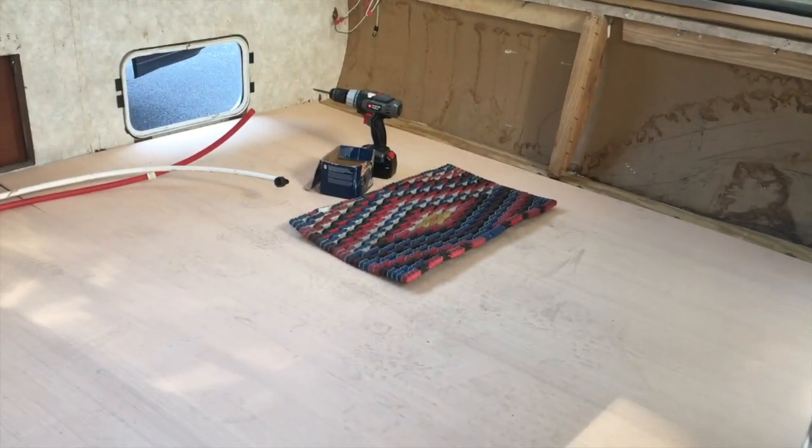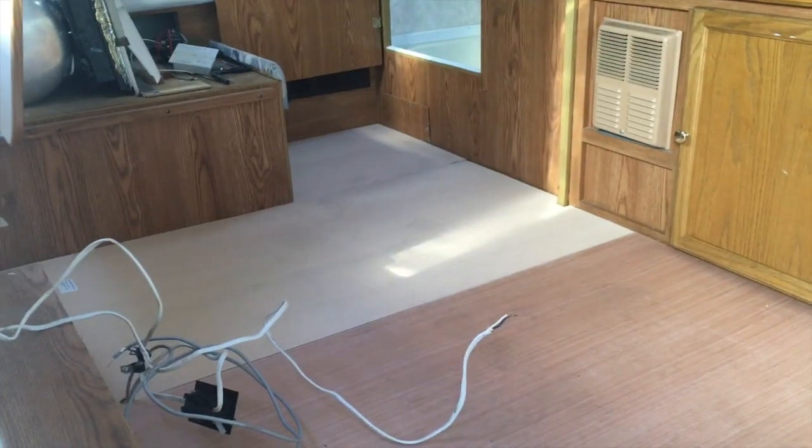We're a couple of hours into day 11. My wife is helping me today. What we're doing is putting down a top layer of Luan plywood. The reason for that is, number one, that's the way you're supposed to do it — you're supposed to overlap your seams and get that finished layer of underlayment. But the other reason is I could not find a floor adhesive rated to go on top of treated plywood and also adhere to the vinyl-padded backing on the vinyl flooring at the same time. So there is my Luan underlayment, dry-fit into place — not too bad, very few seams — and now it's time to screw it down.